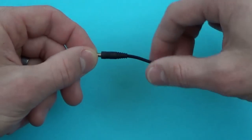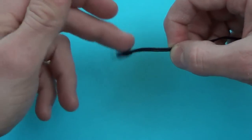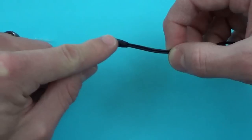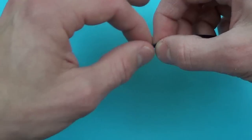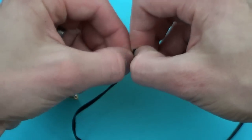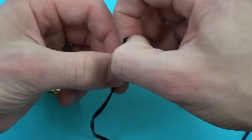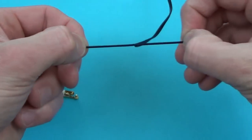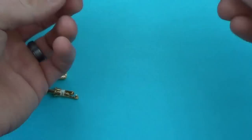So here is the broken plug. I suggest cutting the plug perhaps about three inches away from the original plug — that way if there is a short it most likely is occurring between there and the plug itself, so you're cutting out any bad wire. I might even go a little further up just to be safe. The wire can be split into two — most headphones are set up this way. You can pull it apart with your finger. There I got the wire split, I'm just going to pull down so that I have enough to work with at the bottom.